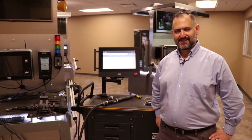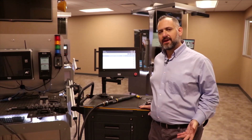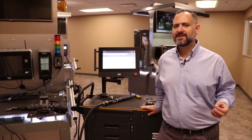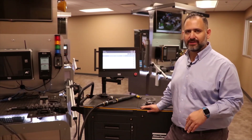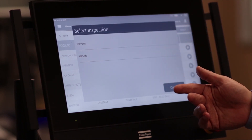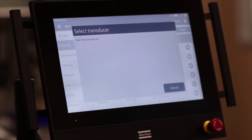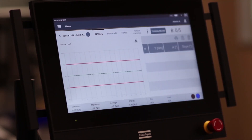The main value of a joint simulation system is the fact that we can reproduce any type of joint rate on a mobile bench. Whenever we want to test the tool in the actual conditions of the production line, we don't have to use the actual joint on the production line — we use the one simulated by the joint simulation bench. We just need to select the tool we want to test and then choose one of the joints loaded into the system. In this case I have a hard and a soft joint — I will choose the hard one — and I will be presented with a list of possible brakes. Once I select it, the bench will activate the brake I need to use.